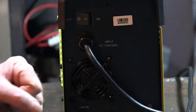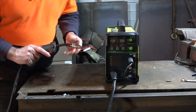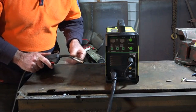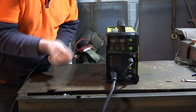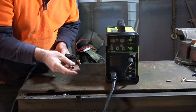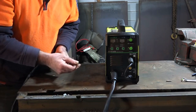That's ideal for me because in New Zealand we run on about 230 to 240 volts, so I can give it a bit more oomph. The MIG welding torch looks like a standard AK-15 torch - a 150 to 160 amp torch, just your basic torch. It's got a push-on nozzle; some of them have a screw-on nozzle which tend to be a bit more expensive. The nozzle holder has a left-hand thread on it of course.